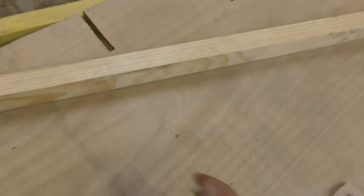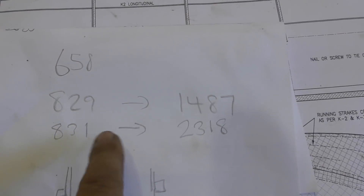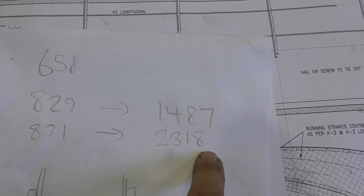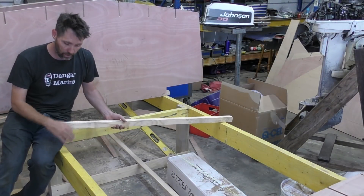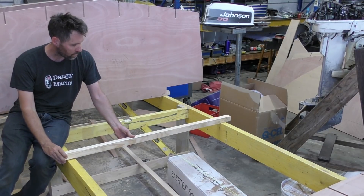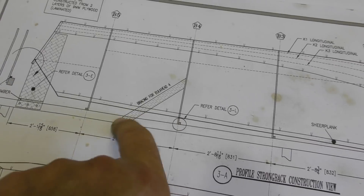To continue the tradition, David Hankin made a donation to help pay for this bit of ply, so this can be bulkhead David. The next reference line along is another 831mm. What I've done here is taken the previous total measurement and added 831, so I'm going to measure 2318mm from the very back here, and then I'll measure this gap to make sure it adds up to 831, giving me a double check that I've got the right distance. In the case of this bulkhead, the batten is going to go on the forward side of the reference line, so I'll clamp that in place and then we'll screw that down. As you can see, bulkhead David also needs some bracing, so I'll put that on now.